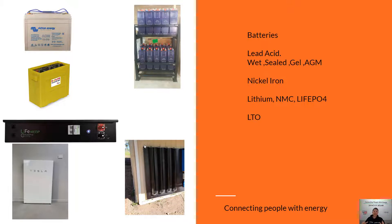This is probably one of the most important decisions to make — what batteries you're going to use — because it's so important to get the right batteries to compensate for what you want to do over time. If you want to grow your system, always remember to add more battery storage up front, because it is one of the most expensive things to add in the future. If you go with a lithium-based battery, you can just continue to grow and add in the future.